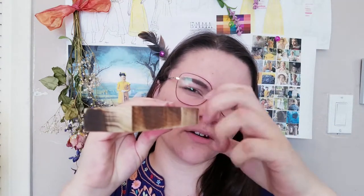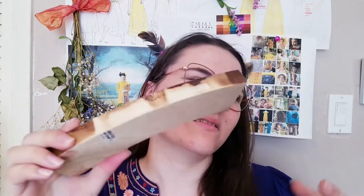look at where you're going to cut, and don't look at the blade, because it's kind of like when you're driving or riding a bike, you want to look at the path ahead and you don't want to look at the wheel super close, because if you do, you're not going to have enough reaction time to cut the wood properly. And what I like about the bandsaw is, if you need to stop or go slower, you can, because the blade is just going in a circle like this. So honestly, you can just stop if you need to, and you can take a break.